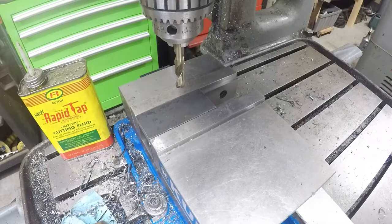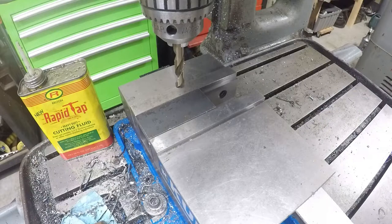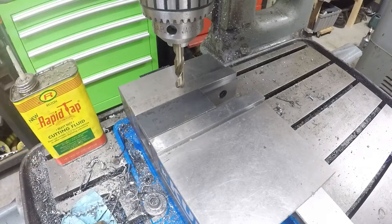Make sure they're clean and you don't have junk everywhere. Without further ado, we're just going to drill this hole. I'm going to be using RapidTap — I love that stuff, it works better than WD-40. WD-40 is only really for aluminum and it works okay for that. RapidTap works really well for drilling and tapping, so that's what I recommend. You don't even really have to use any form of coolant or lubricant on this, but it's better — you'd probably burn up your bit otherwise. So we're going to go ahead and cut this.